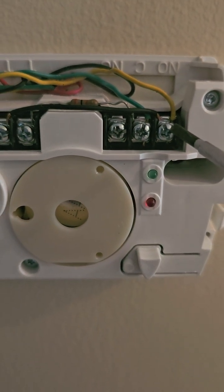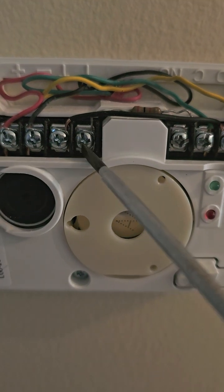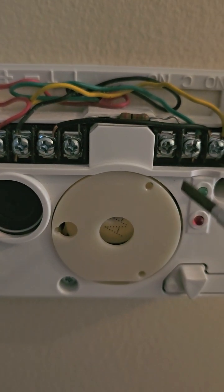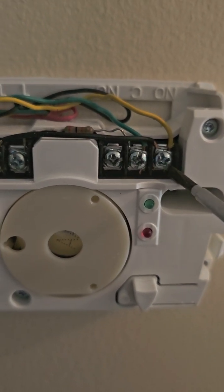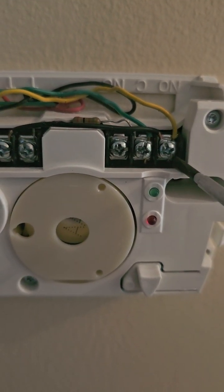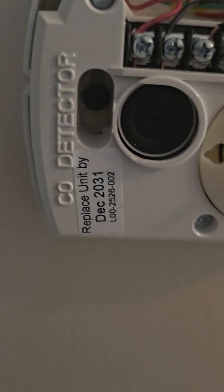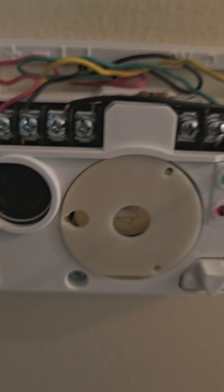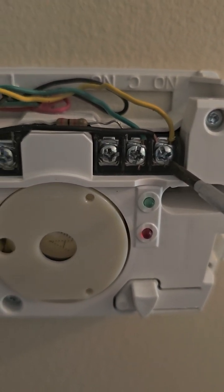It's wrong because if the unit goes end-of-life, the tamper will open up, but it still has two to three months of detection available. The end-of-life is a pre-warning that the unit is about to expire. I just replaced mine, so we're good until 2033.